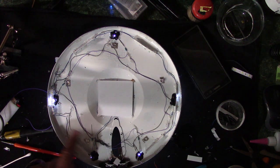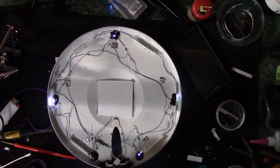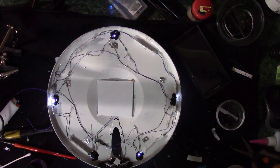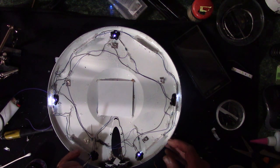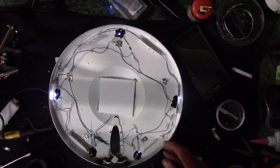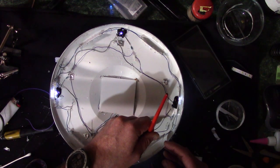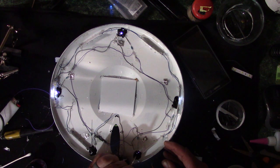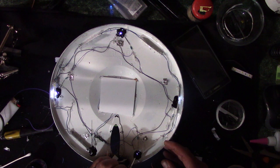Another thing, because they're on resistors, I can just directly power them up. I want to make sure all the light leaks are good to go, and as I thought, a lot of them aren't. So honestly, the best way is to use your T.B.I black, and then just do like I'm doing and help finish off doing the blocking. It might take a couple of times, but there.